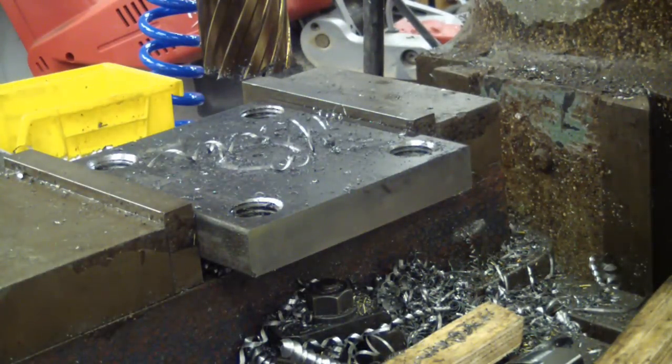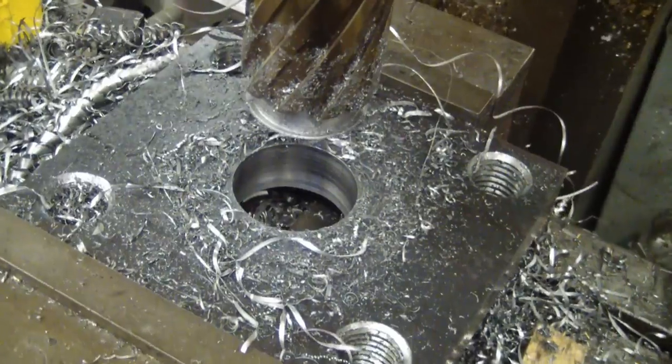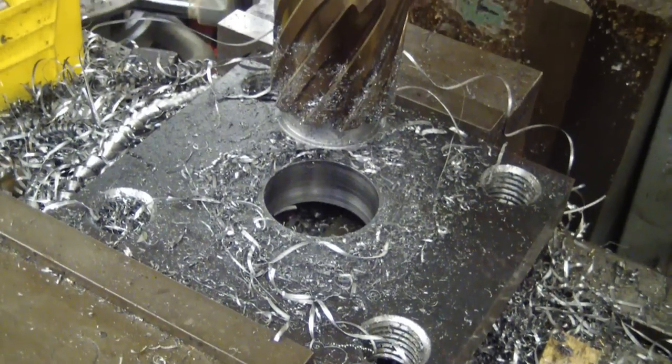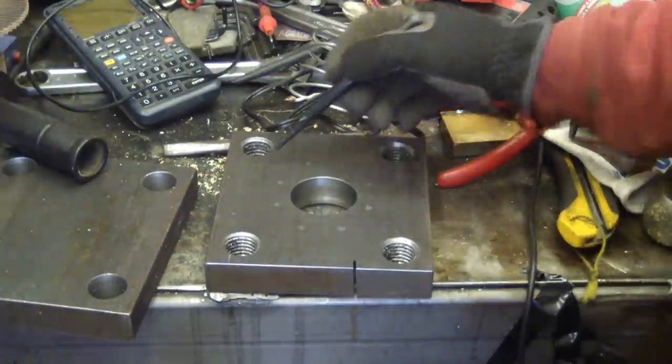The drive tripped out — it'll do 200% over-torque for 90 seconds — but that is a beautiful two-inch hole, compliments of the annular cutter and the old worn-out Bridgeport.